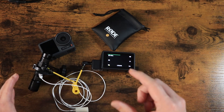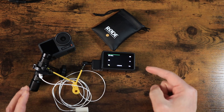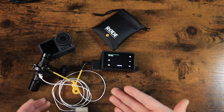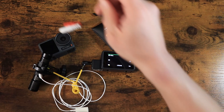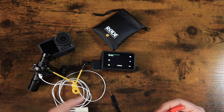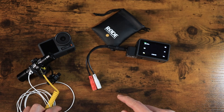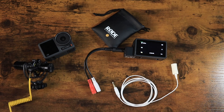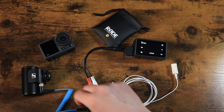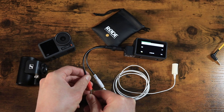This specific combination of microphone, adapter, and lav mic work really well together because you only have one gain adjustment — in the camera — so whatever you adjust will affect both microphones. But if you want to use different mics, you can use a splitter. This splitter functions the same way the Duo does, splitting your channels left and right, giving you two different dedicated inputs for different audio sources. So if you don't want to use a D4 Duo or D4 Mini and you have something like a Sennheiser MKE 200, you can plug in your lav on one side and your other microphone on the other side and you'll be good to go.